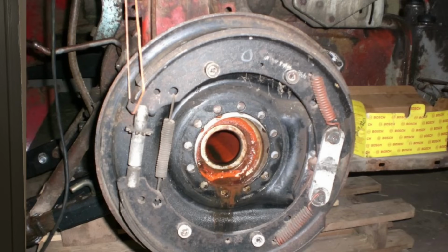The 135 came with a full lighting package with Butler type headlights, rear plough and tail lamp from Heller with reflectors from Lucas. PTO and 3-point linkage was standard, as was a swinging drawbar. A differential lock was standard fitment. The brakes on all models were mounted directly on the wheel hubs and were the internal expanding type by Girling.